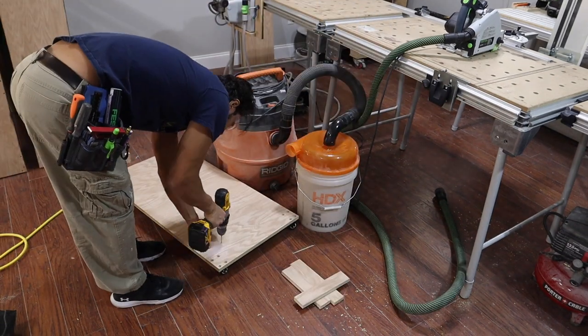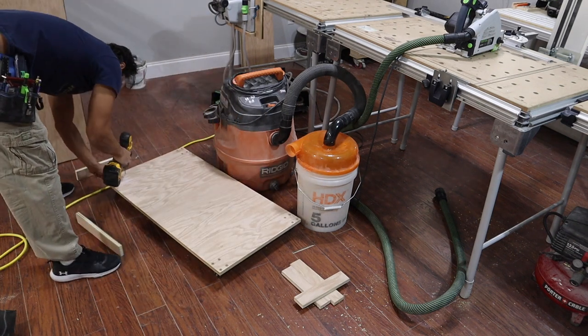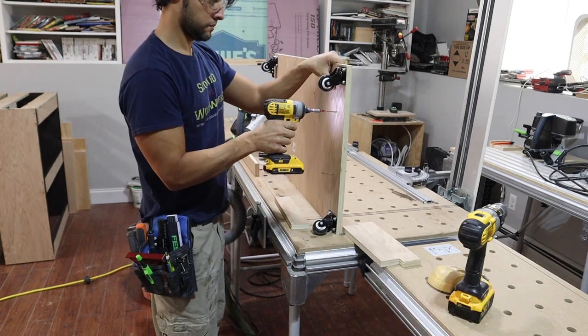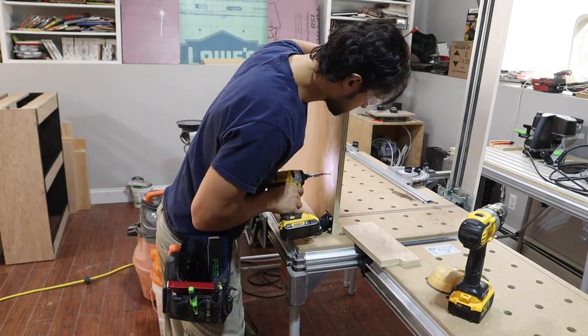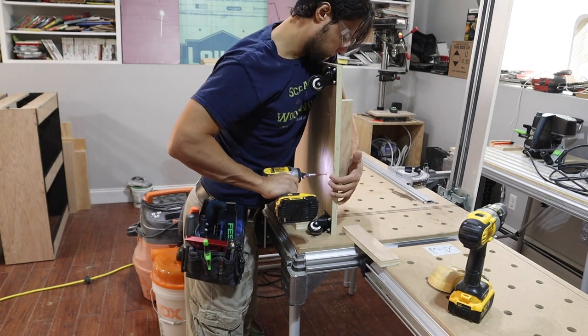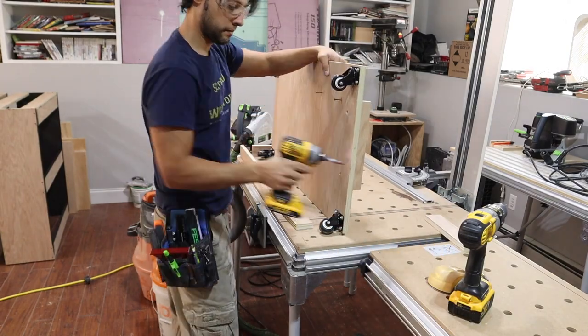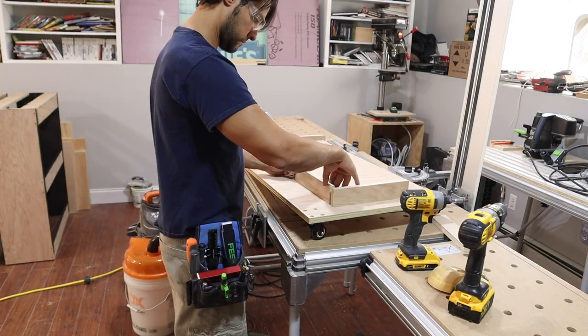I'm going to mark up the shop vac and the dust stopper in place and put a couple of pieces of scraps around them as brackets just to prevent it from sliding off as I move the cart, or tipping over when I'm using it. Using a pencil to trace out the lines of where those brackets were, I know where I can pre-drill the holes for the screws. This way I can install from the bottom and won't be screwing in the brackets blindly — I just flip it upside down and install the screws exactly in place.